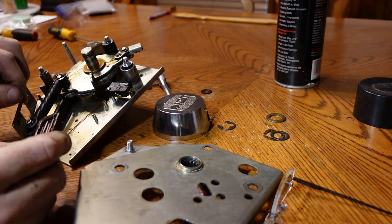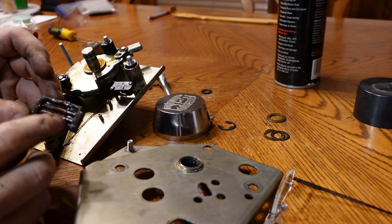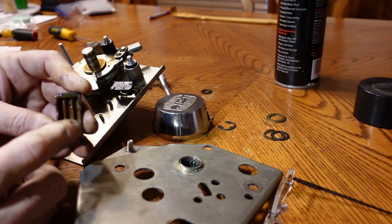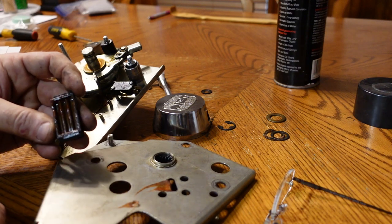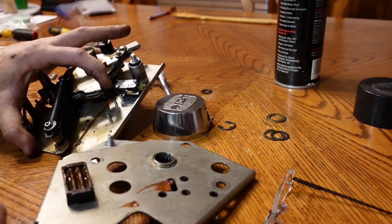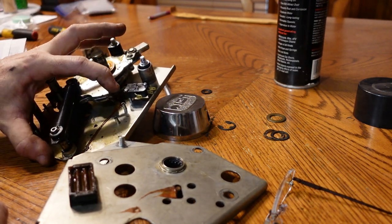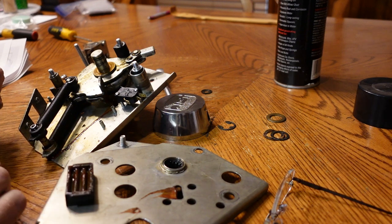There is a puddle of goo directly under this on the floor of the machine inside. I believe that this is supposed to have a bumper attached to it. That is your bumper. And somehow it turned into melted sticky garbage and came out of this piece. That is my guess. And that is most likely what's causing this to over-return and not allow this piece to reset properly. I think that's what's going on, because there is a substantial puddle of snot that's hardened and sticky